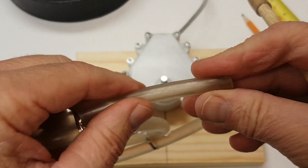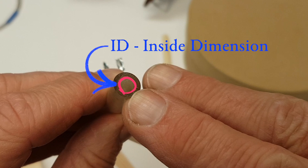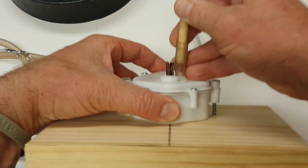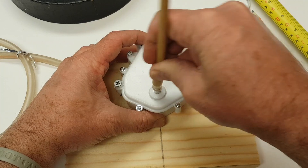To attach the wooden dowel to the rotating shaft of the motor, we're going to use the vinyl tubing to create a compression fitting. You can buy vinyl tubing at a hardware store, and when you do, you want to look at both the OD, which is the outside dimension, and the ID, which is the inside dimension. You want the ID to be the same or slightly smaller than the rotating shaft on the motor, which is also the same size as the wood dowel. Using a small piece of that vinyl tubing, slip about one inch of the wooden dowel into the tubing, and leave enough of the tubing so it can slip over the rotating shaft of the motor. The fit should be snug.